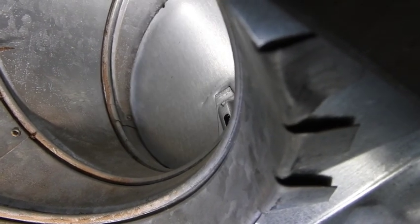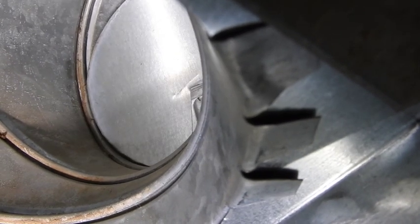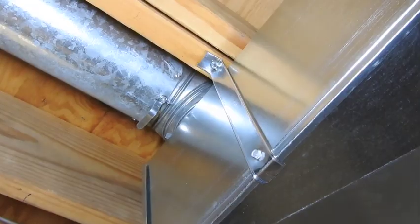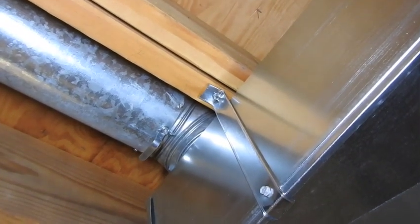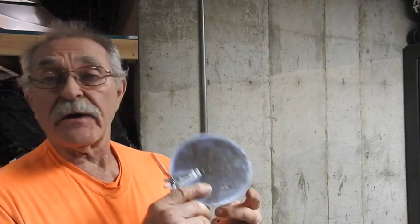This particular one happens to go into a half bath, so it's going to stay just about completely closed, or maybe just a slight tweak, because there's no need for a tremendous amount of air — in heating mode or cooling mode — for a small bathroom. Here it is from the outside, and that's typically the closed condition you're going to almost always see if you have branch-ducted dampers. When installing these, you have the option to stop by the supply house and pick up the plasma-cut pre-made ones. In the old days they weren't plasma cut — they used circle shears to make these.